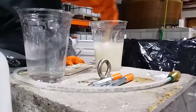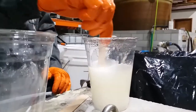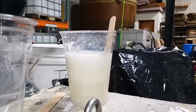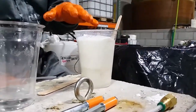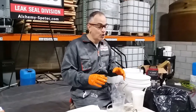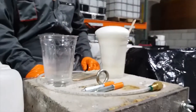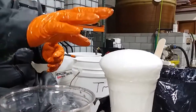This is not an aggressive expansion grout — it only has about four to six times expansion. And we're already starting to expand — about 25 to 30 seconds gel time. I use gel time and set time a bit interchangeably, but it's still tacky so it's not fully set up. That gel state typically will stop our water. Some people have seen other grouts that expand a lot more — we have grouts made exactly for water cutoff and void filling — but this is a flexible grout designed to go into a crack or joint, so it doesn't have the fast reaction or heavy foaming you classically see.